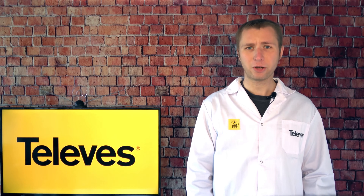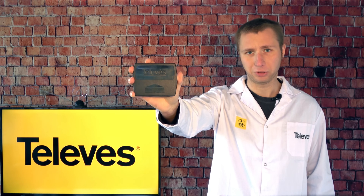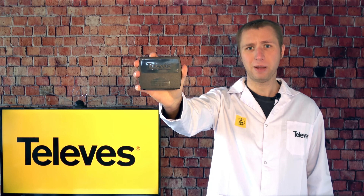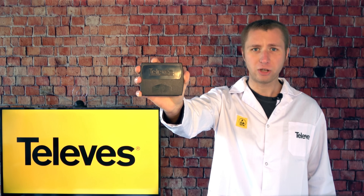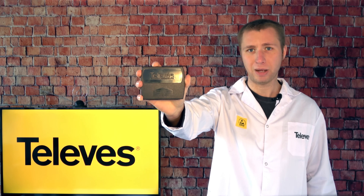Before I get into the actual review, I want to bring to light a few things. On the outside, the average person may see most antenna preamps as the same — I know I sort of did for a while. However, it's the small things that can make a great preamp. Some of the features on this preamp that aren't present on most others include very precise band filtering, meaning the preamp is only amplifying low VHF, high VHF, and the UHF band. This blocks out interference from the FM band and from nearby cell towers.